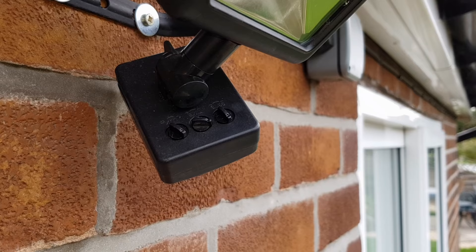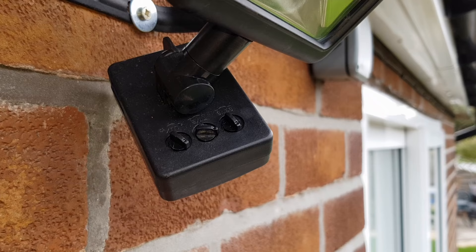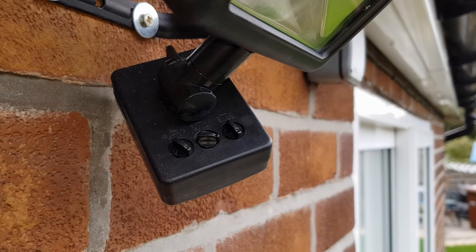The customer has also asked that we only have the light on for a fairly short amount of time, so we've left that the same. And then the lux setting — you're going to have to suck it and see, and try which you like when the light comes on. We tend to go for about halfway if we can help it — it's sort of an average balance between light and dark.